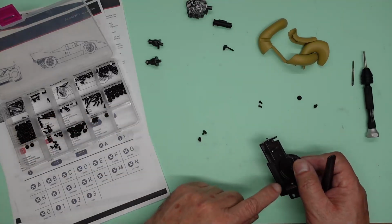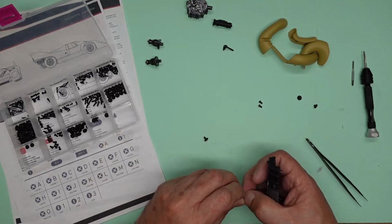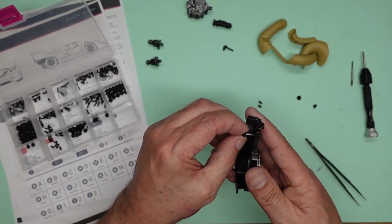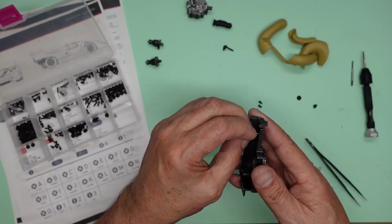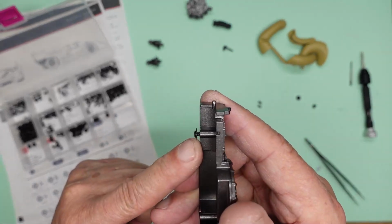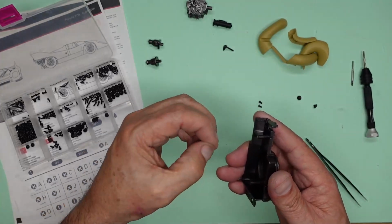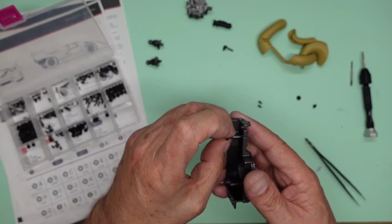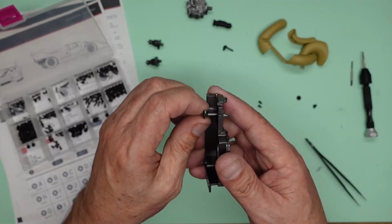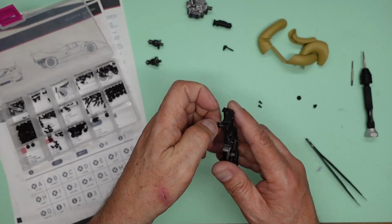Now, I've already thread cut these and it's too late, but just to show you the difference, this is the 2.3 by 3 metal screw, okay, and it's got the coarse thread, and as you can see on here, I can wind this in, go about a turn and that's it, and I can't turn it anymore. My finger, that's the thread I've cut. Okay, so that's that one. Now this one here, which has got a proper M 2.3 thread on it, look at that, I can wind it all the way in by finger. Okay, so that's the beauty in thread cutting.